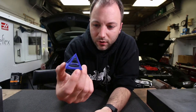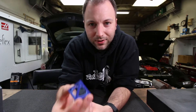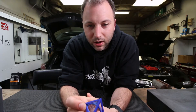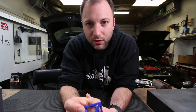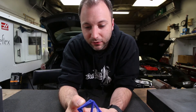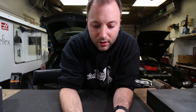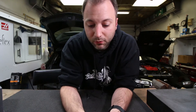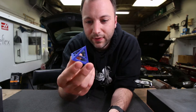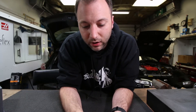Stringing can be the result of many different causes. One of the first ones obviously can be retraction settings, but I'm using PLA with the slicer settings provided by Prusa for the Prusa i3 MK2 with PLA, and it prints PLA pretty fantastically. Proto Pasta is normally a good filament brand and I've printed with this before without this problem, so it really narrowed it down to one possible cause: I must have left the filament out in atmosphere too long and it absorbed some moisture.